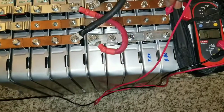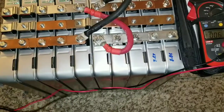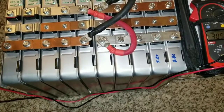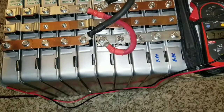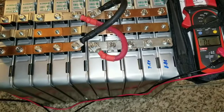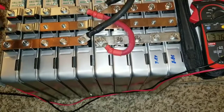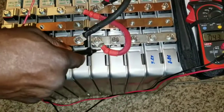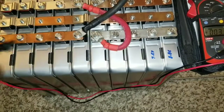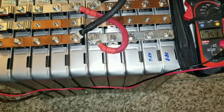These cells are balanced! I can go this way, go this to this — three point seven five. And coming from here — three point seven five. All of them are going to be like that. So the batteries are properly balanced. I can't complain. These are the best.